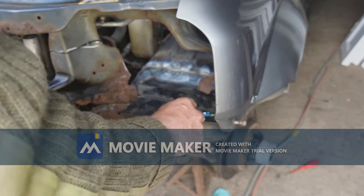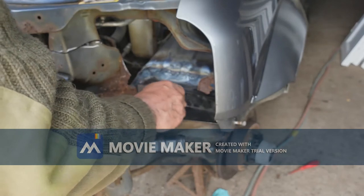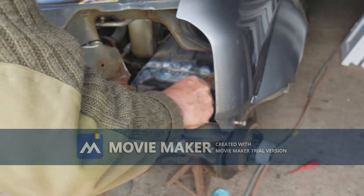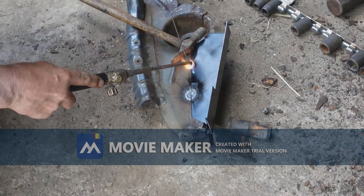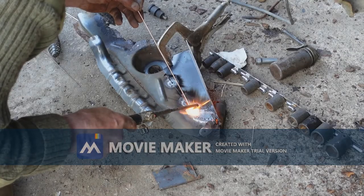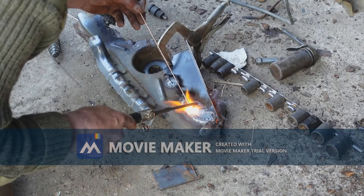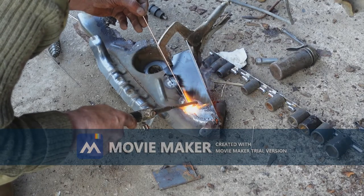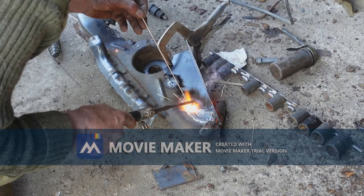Making references to my fixed points, this is going to be the first piece that we're going to weld on. I'm just tacking the thing together now, and then we have to fill in between the tacks with weld. It's a time-consuming job, but we work that rod in and out of the pool of molten metal to ensure good penetration and a good solid weld.